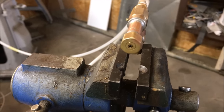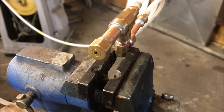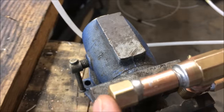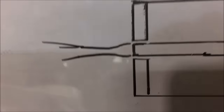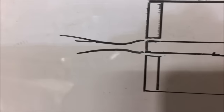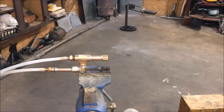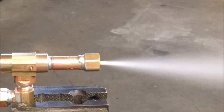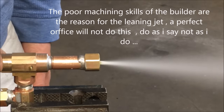We have a little test stand here with the nozzle set up. After some pre-testing, I found that you want the oil spear in the middle to be flush with the face of the air discharge — like what I've drawn — and that turned out to be the optimum position, giving us the most spray. You'll see a vena contracta when you're at the optimum position. I've added some orange food coloring so we can see the fluid traveling through the line. Starting the airflow, almost instantly the water travels through — this thing is working beautifully.